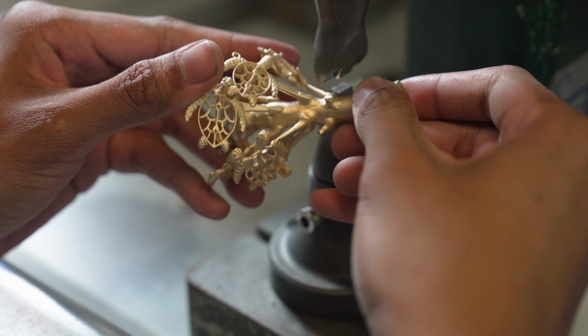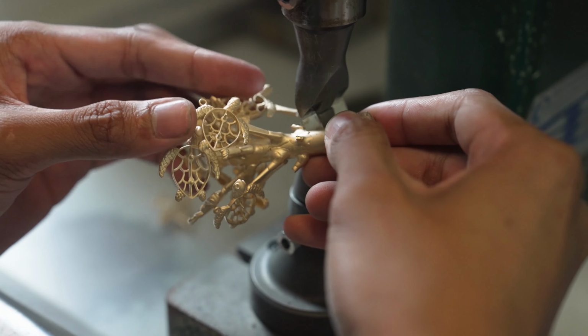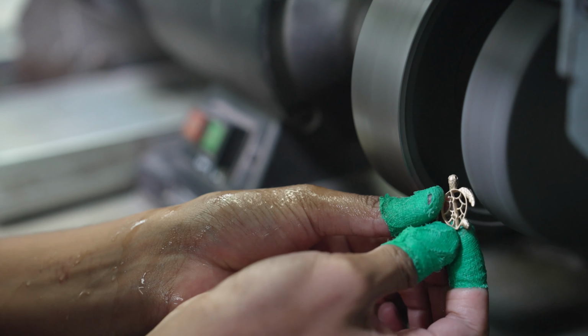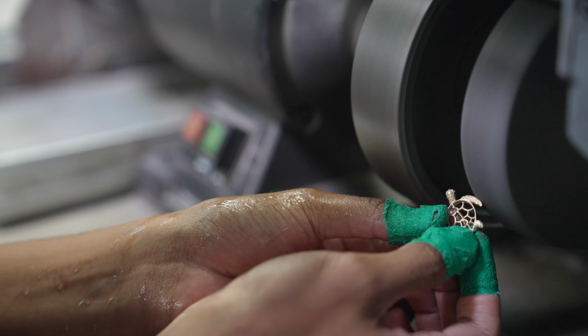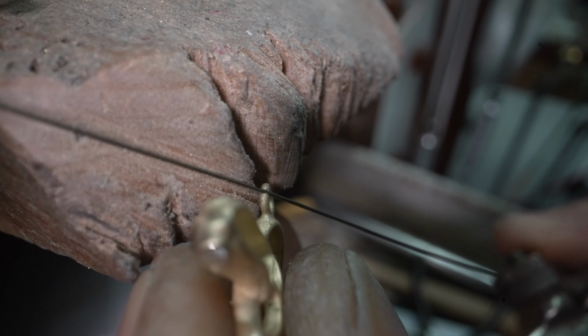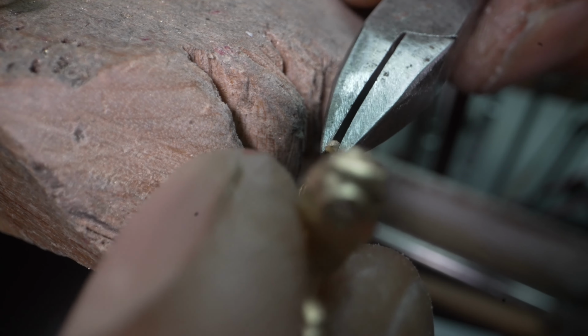In processing, the raw jewelry pieces are cut away from the gold tree with a hydraulic cutter. In several dedicated stations, they are sanded with wet silicon carbide discs to remove the crust from casting. At this point, the jump ring of this honu pendant is finely cut and a bail inserted into the jump ring.